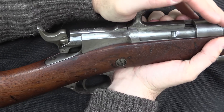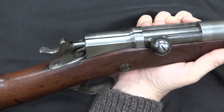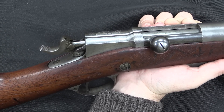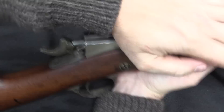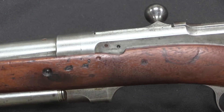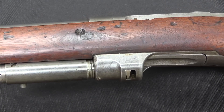With this prototype, you can see when I push the bolt forward, it automatically cocks the striker back. So clearly Remington recognised that this manual cocking thing was, frankly, a dumb idea that was instituted only because the military insisted on it. Their experimental version here does more than just improve safety — it also improves efficiency and handling. Lastly, it's worth pointing out that the magazine cutoff was also never installed, probably because it would interfere with this new magazine system.